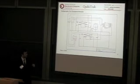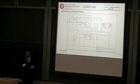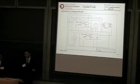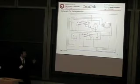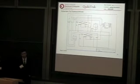Now, on the receiver side, we receive the signal from the receiver, and that also goes into an optocoupler, which then steps the voltage down to 5 volts from the 11.1 volts coming out of the receiver. And that then goes into the microcontroller, which detects the traffic violations.